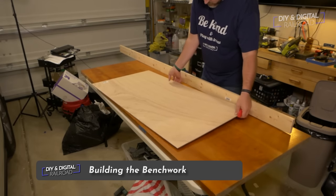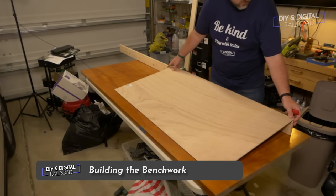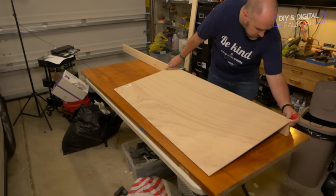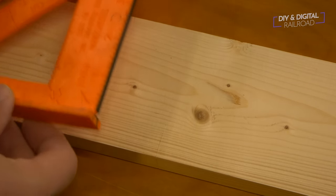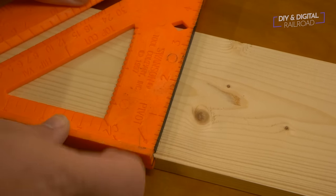If you intend to cut the lumber yourself, here is what you do. First, mark the lengths you'll need to cut for the 4-foot side of the board first. Then, mark your cut line. I used a speed square, and I actually scored the line rather than cutting it using an X-Acto knife, but you can use a pencil or pen or anything to mark it.